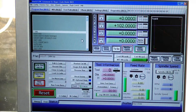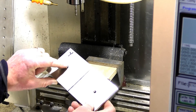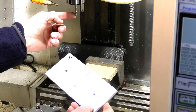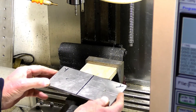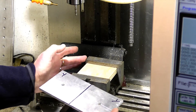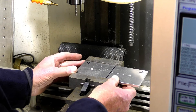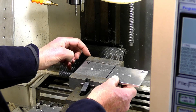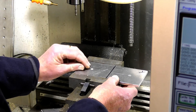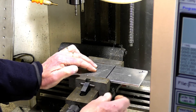The next job we need to do now is to find the zero — or the start of the program — and have a piece of work. I'm going to make the zero zero this hole in the middle here, and I'm going to do that with a six millimeter three flute end mill. You need to have some sort of datum point on your fixture. The datum point is normally this corner — it can either be this corner of the jaw or this corner of the jaw on a milling machine. So we're going to make this corner here our datum point in relation to our material.